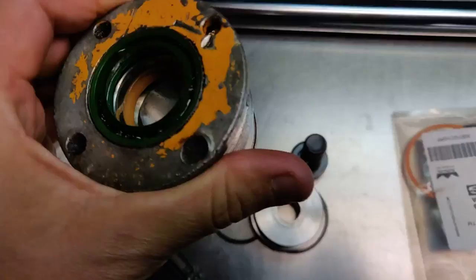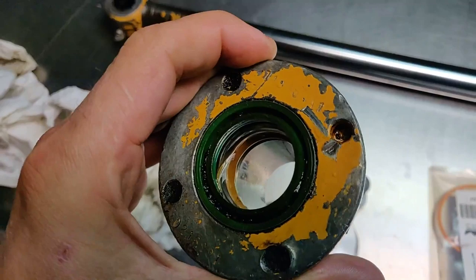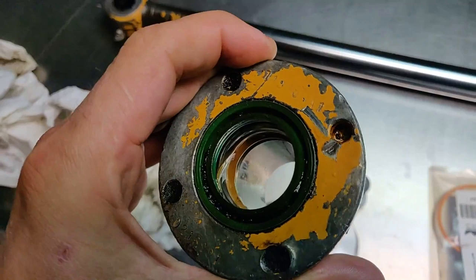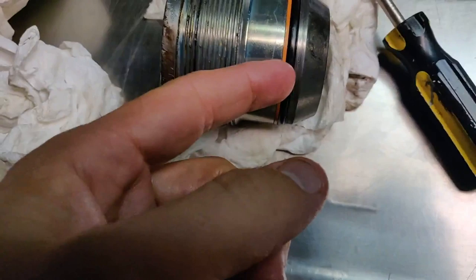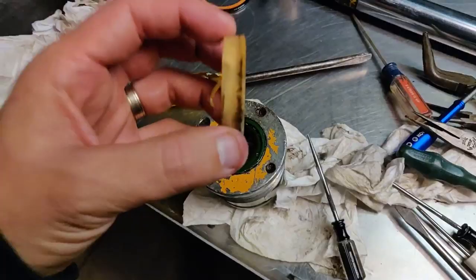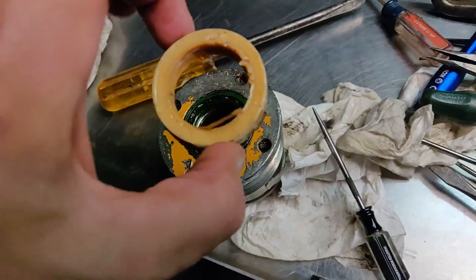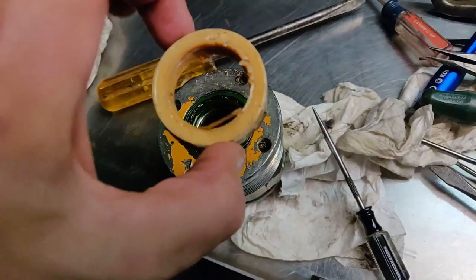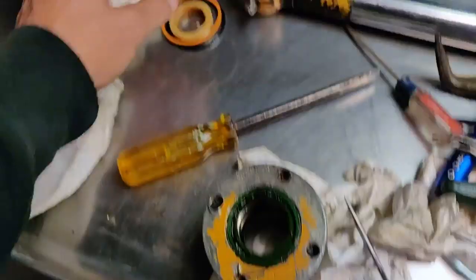I found out where the seal failed — you can see that little broken spot on the yellowish interior seal right there. That's probably the one that failed. Let's attack the easy ones first: the o-ring and this orange flat one. Got those two out — simple. The interior seal was tricky to get out — I had to use a straight point tool to jab into the top and pry one end over. It goes in like this: if facing up, the bottom center lip goes down and it gets inserted that way.